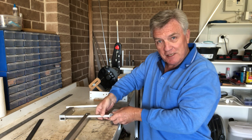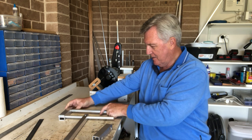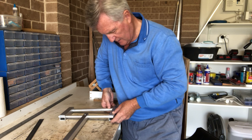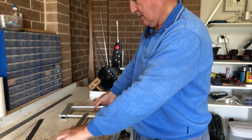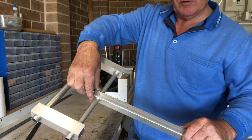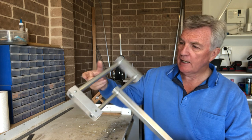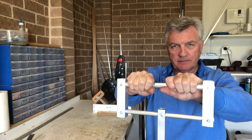So I'm going to try an experiment. I fitted the basic handle — and you could stop here if you want and just use that — and all I've done is run a 4mm bolt straight through it. But I've also drilled through these two pieces of 32mm square scrap with 16mm holes through one end and 20mm holes through the other, and the plan is I'll fit them to the handle. There's no hard and fast size for this, it's just whatever seems to fit my hand.